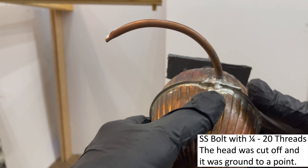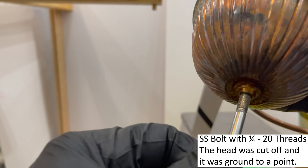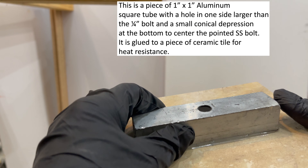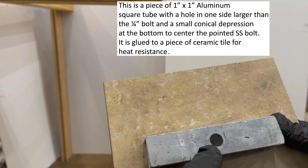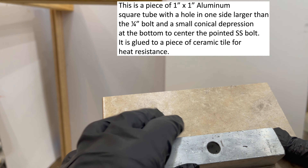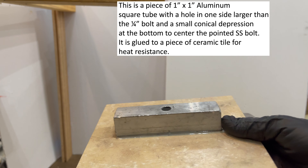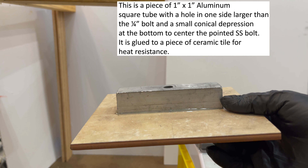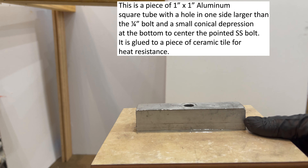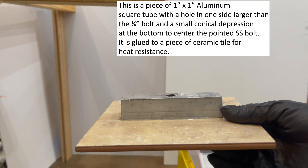On the bottom, similar thing with a bolt — in this case stainless. It doesn't have to be ground off to a point, but that minimizes turning resistance. I took a piece of square channel I had laying around and drilled a partial hole with a drill bit which left a conical depression. That's the resting spot for the bottom of that pointed bolt, and that's how it holds with minimal turning resistance. I also used a piece of ceramic tile left over from a floor project, glued on with JB Weld plastic. Since I'm putting heat on this, I wanted something heat-resistant.